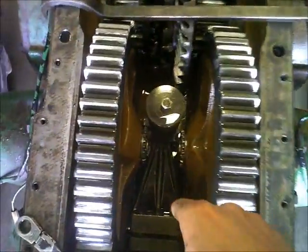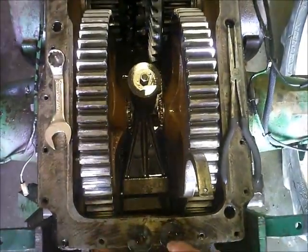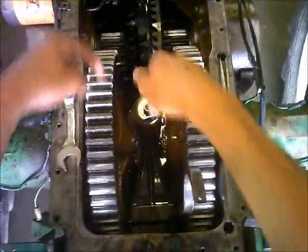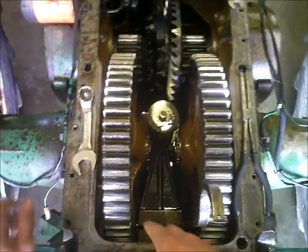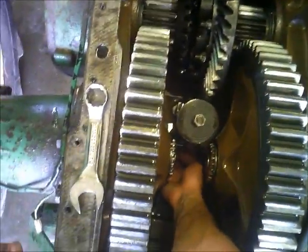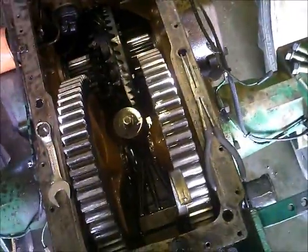Alright, now that's out of the way. I've got to get down there to those bolts, release them, and actually let the shaft split and slide out either side. I got the bolts out and the washers out. These act like keys — they go in there, one on each side of the shaft. The shaft splits in the middle. They act like keys, they go in on the slot and then you put the bolts through them. That keeps the shaft from spinning. And what this is is an arm that comes and works up against this box car spring, and that's what sets your draft pressure.